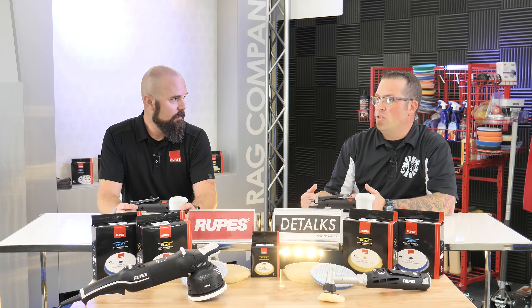If you're trying to grow your shop and you have two, three, or four bays with every guy running an airline — or even just two bays with four employees, two on either side — you've got four airlines running at once. You're going to run out of air on that little pancake or 10-gallon compressor. You need to step up to a 60, 80, or 100-gallon tank just to have the capacity, but a lot of guys don't think about that.